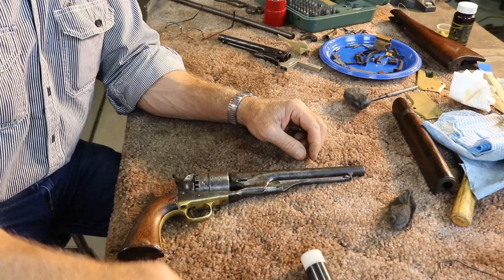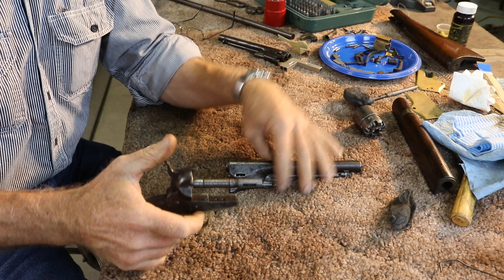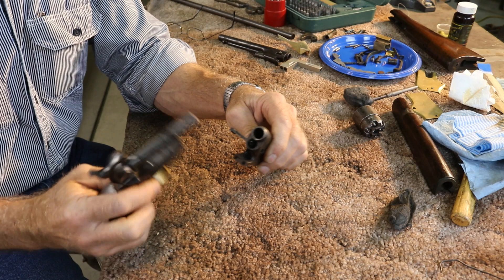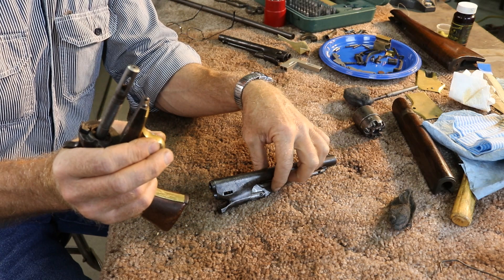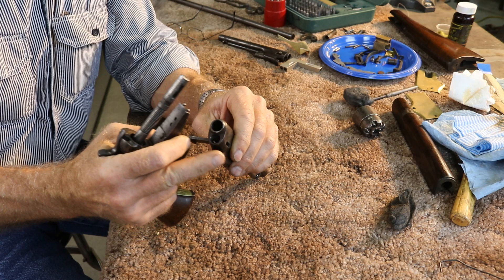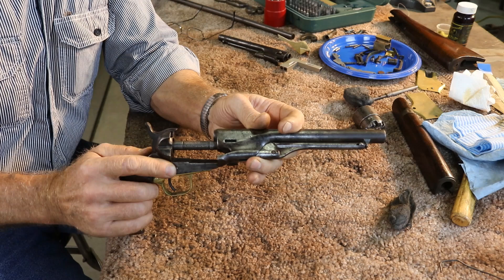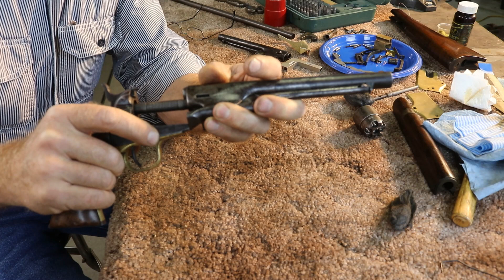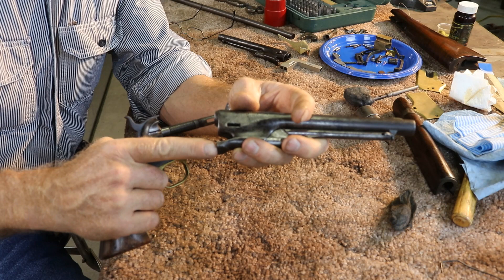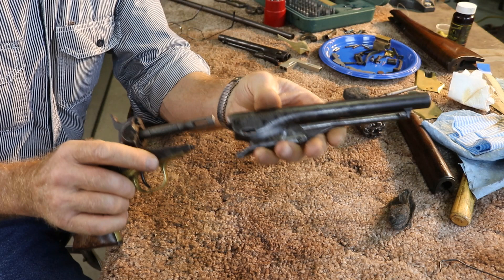Let's take the cylinder out. We can see the end of the arbor that fits in a hole here and bottoms out at a certain point. Then we've got these two surfaces that come together, and there are two locating pins in the front and two holes that locate the barrel. If everything's set up perfectly, we put it on the arbor and it bottoms out, and this part lines right up. When I adjusted it, it just ticks there — maybe a thousandth off between the two. The fact that the end of the arbor and the lower surfaces virtually come together at identical times is what keeps the barrel in alignment.